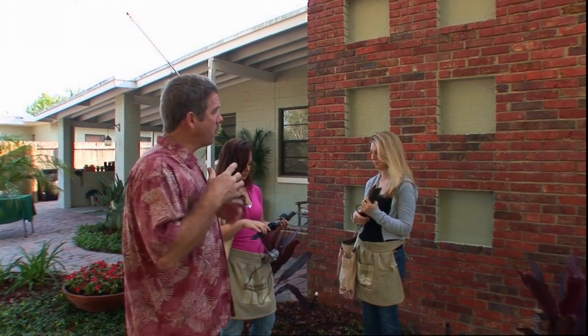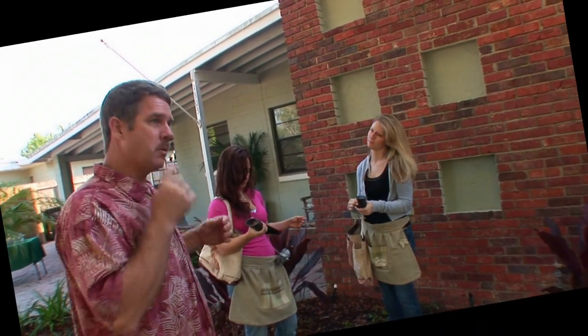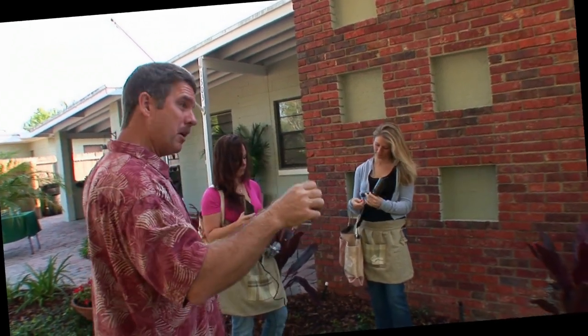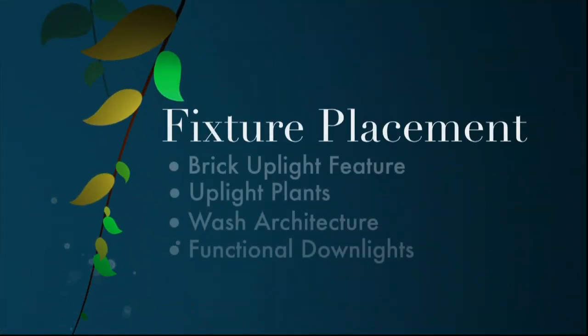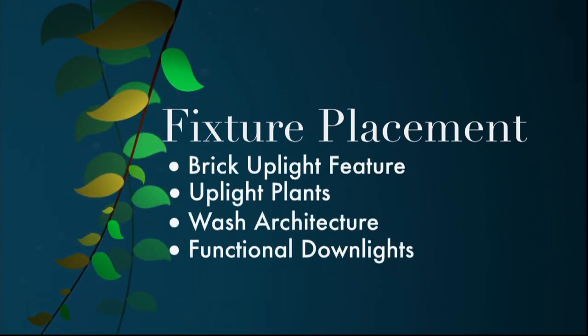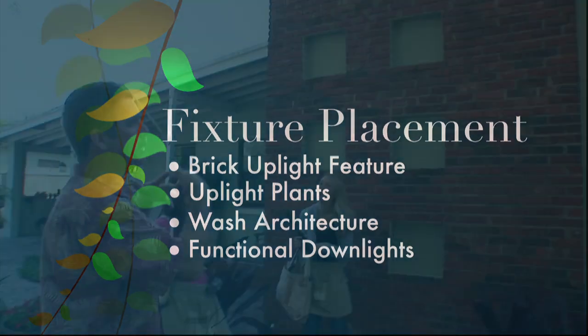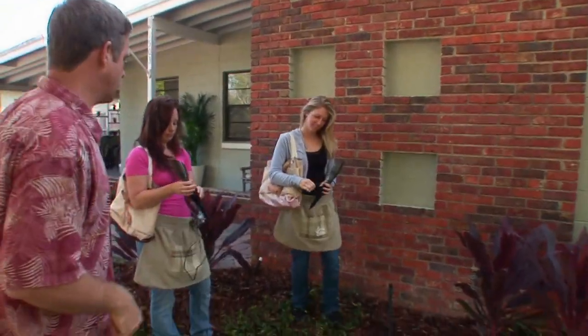What we want to do is look at the house and balance our lighting. You want to have a light over here, a light over here, and a light in the middle so it's balanced. We want to highlight architectural features, so we're gonna light some brick over here, we're gonna light a plant over there that looks really nice, and we're also going to give some functional qualities with the path lighting so we don't trip up the walkway. So we're just gonna up light your brick here — let's go ahead and set some fixtures in the ground.